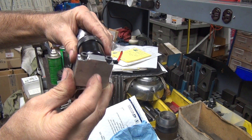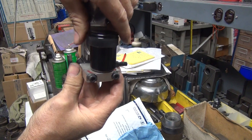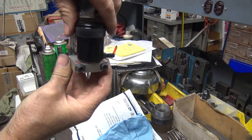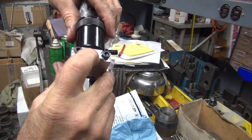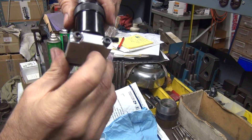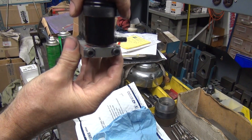I don't know if you want to use a flat head down here — just put a button head here. I think we should drill a hole, recess it, and use an allen bolt. We can just screw it in — it'd be pretty thin if we did that, but yeah we can recess it. A button head would be pretty close too, but whatever you want to do.